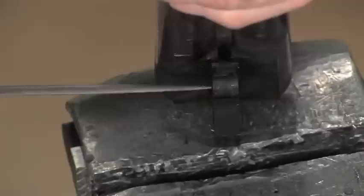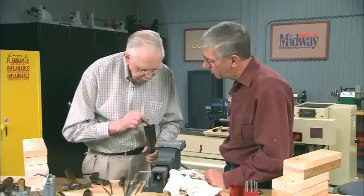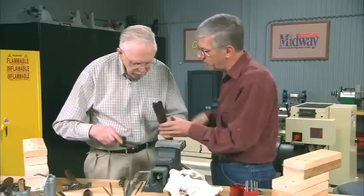The next move, I'll give it a polish with a fine emery cloth, and then we've got final fitting. We take the metal off here and here on the face where it's touching now until it fully closes and we can get the underbolt in. What we're doing is we're trapping the barrel between the hinge pin here and the face of the breech. That's so it touches here and it touches back here and it really doesn't touch anywhere else except the locking bolt as it closes. That's right.